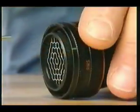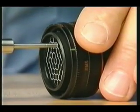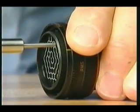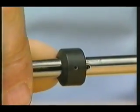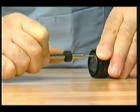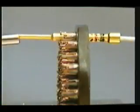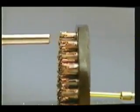Keeping the tool perpendicular to the insert, center the tip of the removal tool over the tip of the contact. Insert the tool until you can push no further with reasonable force, and while holding the connector and tool in place, push the plunger ring toward the connector. With a little practice, you can do this in one smooth continuous motion. The retainer is high-quality beryllium copper designed to withstand up to 10 insertion removal cycles.